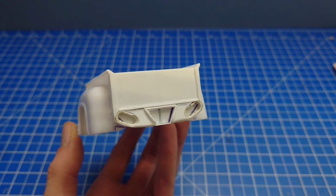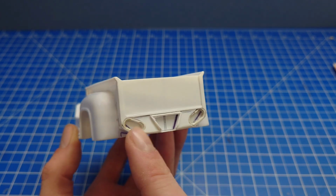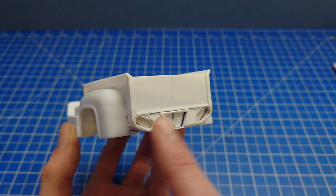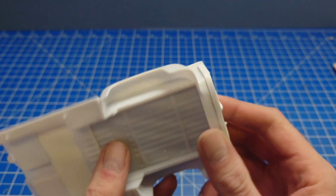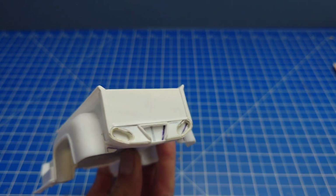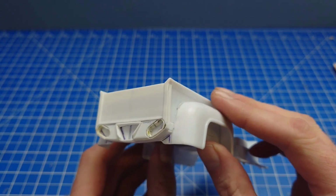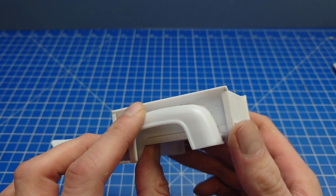They fit inside of here lovely now. I think I've got a little bit more sanding to do. I'm just going to wait for the final body filler before I trim those lights down. But we built behind all this quite a framework of sheet styrene and everything else, which we needed to make up that rolled rear pan.